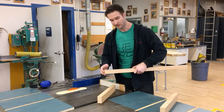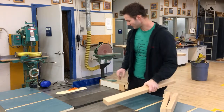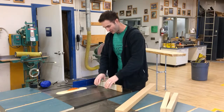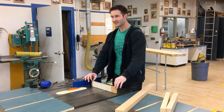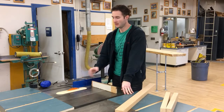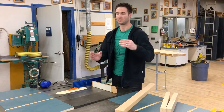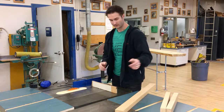Knowing that, we need to start doing some machine set up. We're going to be using this table saw — our dedicated cross cut table saw — with a miter gauge. I've got this set up with some sandpaper on here so that your wood's not going to move around. I've got it dialed in exactly at 90 degrees, and because this thing can be bumped and moved, you really do need to check that it's exactly 90 degrees before you do all your set up. That's going to make sure that my shoulder cut is perfectly square, so my stretcher is going to go into my rail with no gap from that shoulder — it's going to butt directly right into the side of the rail.